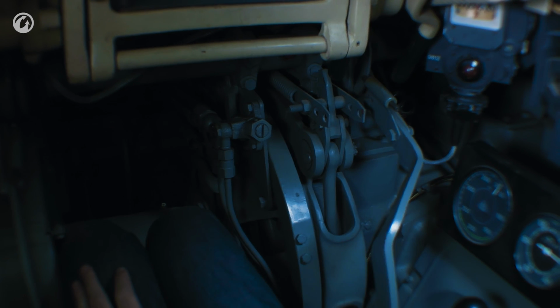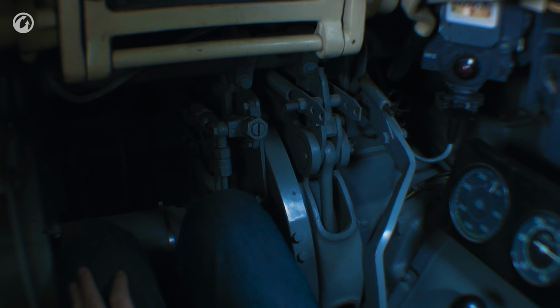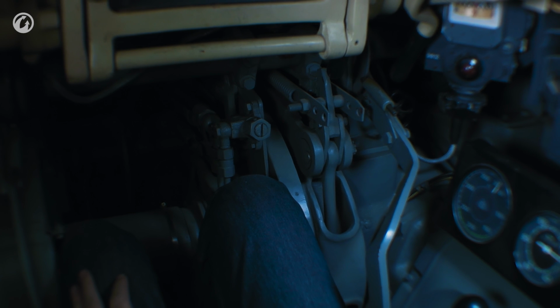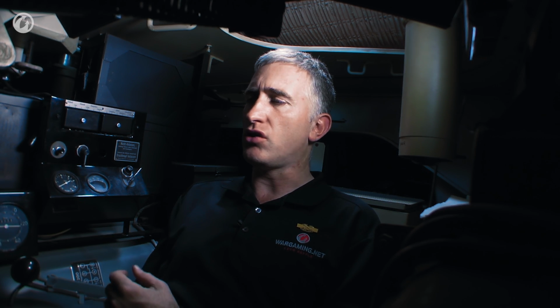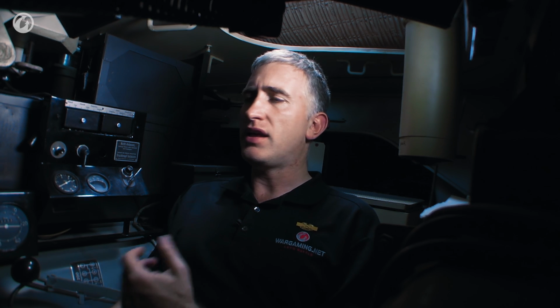If you bring it all the way up to a notch position, what you've now done is you've engaged radius steering. And this is a fixed gear ratio. Power does go to both sprockets at all times, however, at different ratios. So depending on what gear you're in, your steering will be different accordingly. In first gear, your steering radius is 5 meters. In 7th gear, it's 80 meters.